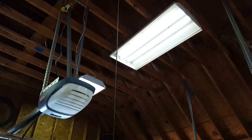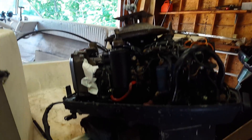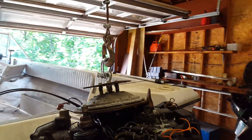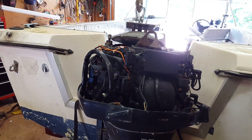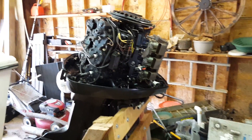We got our pulley up there — it's like 650 pounds — and we already got a little bit of tension on it. We got to take the bolts out, put a little tension on it, and then we're just going to lay it on the ground down here. We're going to put our new motor on and put the old motor on this stand.